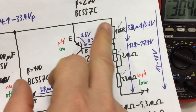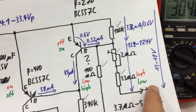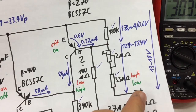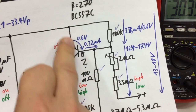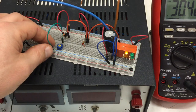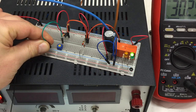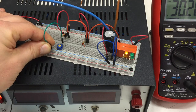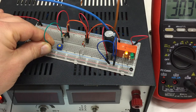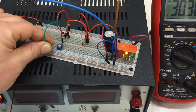And if you look at the circuit, if this goes open, that transistor goes off and our relay should switch, because where should the base current go if that is open? So if I pull our sense line from the ground rail, nice. Now, so far, we haven't achieved that much, but kept two transistors busy to switch a relay.